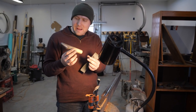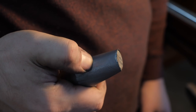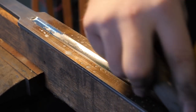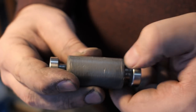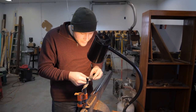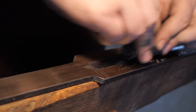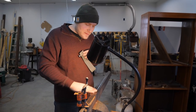I've got a couple of sanding sticks I made for this. One is just a chunk of handle material that I rounded to fit down in the fuller, with a couple layers of duct tape on it to make it squishy — then I fold a piece of sandpaper around it and go to town. I also use that in combination with this round wheel that I ground the fuller with, and I have some tape on there to make it a little bit thicker — the same diameter as it would be with the sanding belt going around there. This paper is a lot thinner than the sanding belt so there's extra tape on there to match the diameter. I use this one mostly on the ends since the wood block doesn't get up close to the end very well.